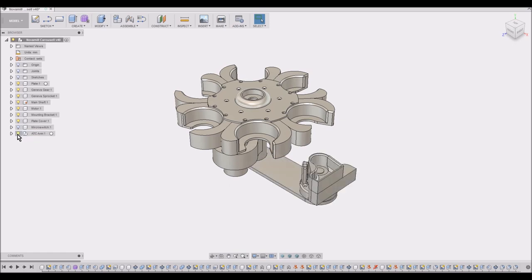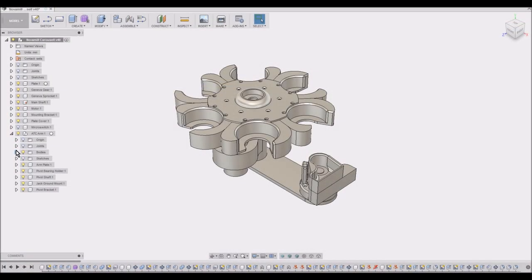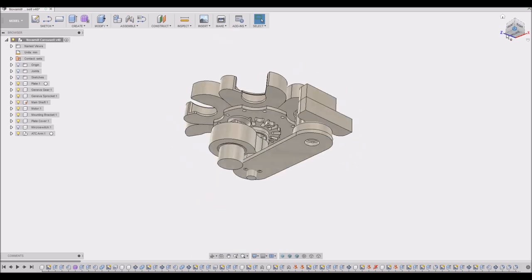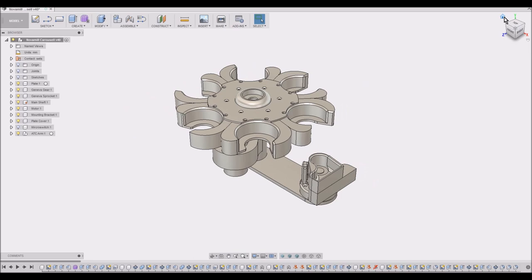So if I drop in the arm now, as you go down through, there's obviously an arm that sticks out and some mounting equipment. Now this pin here is quite interesting — that's what actuates the micro switches. There's a micro switch and then there's an adjustable M3 screw that you can use to figure out how that all works, and that ties in with the electronics standard setup in Novomil. As you can see when we look around here, it's reasonably compact. That plate on the bottom I'm going to machine from aluminium, though some of the flexibility issues I've been having are not great, so we're going to have to look at that later.